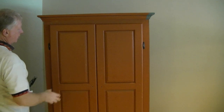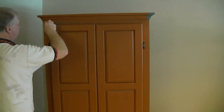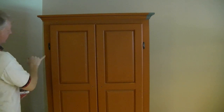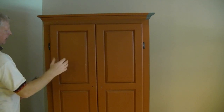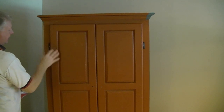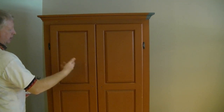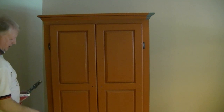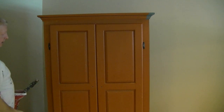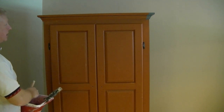Because of the doors, we're going to paint them first, then paint our crown mold at the top, then the frame we can see. We're going to open our doors and finish painting the frame inside while the paint is still wet, then paint the inside of the doors. So while we're painting the frame the outside is getting somewhat dry. By the time we open them up we can paint and hopefully we don't damage the outside of the doors too much. Let's get into it and see how it goes.